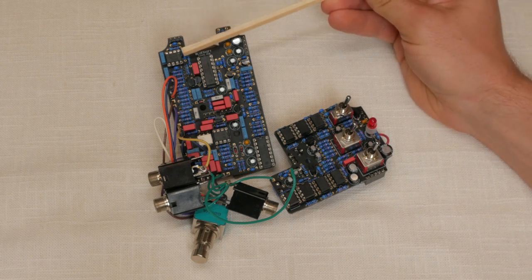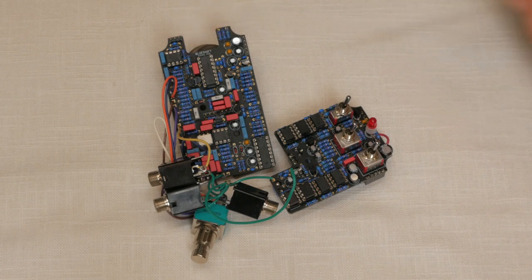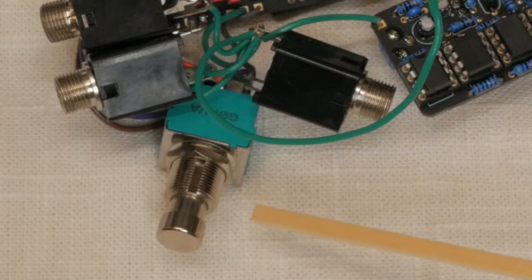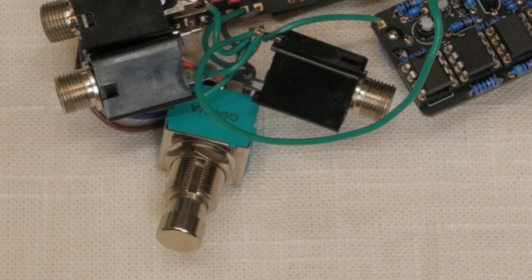The reason you would want a higher quality part here is because the op amps are in the signal path. For my 3PDT, I used a Feathersoft latched foot switch from Love My Switches. The switch is rated for 30,000 cycles. The switch also has a high temperature epoxy which can handle up to 350 degrees when soldering. I picked this switch because it's teal.